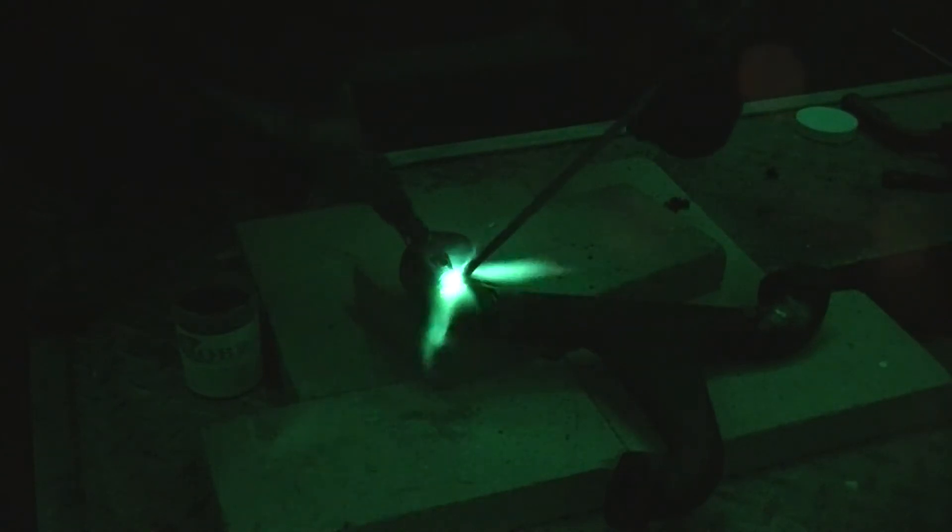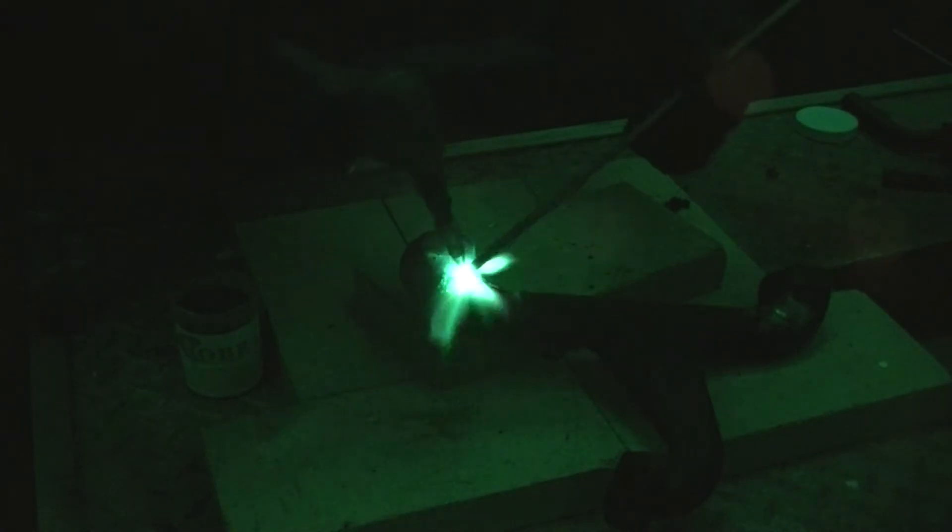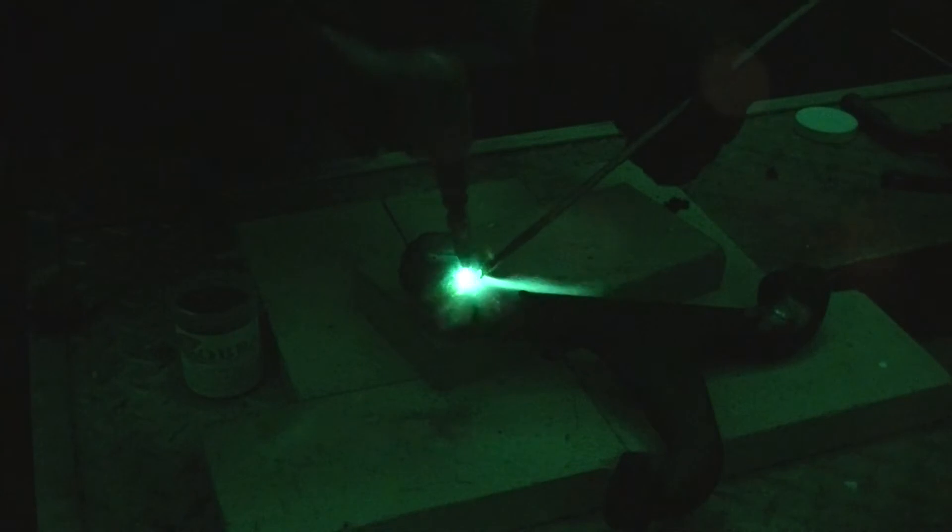Very natural to the material. Now this will become machinable — we can machine it, drill it, tap it. If we had to replace an ear on here we could build that ear up, drill it out, put it on the lathe or on the Bridgeport, machine it out.